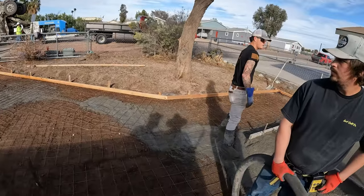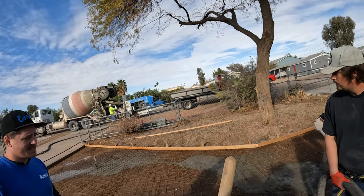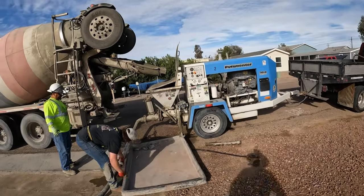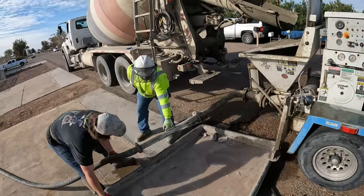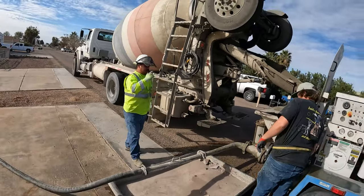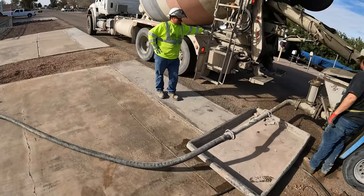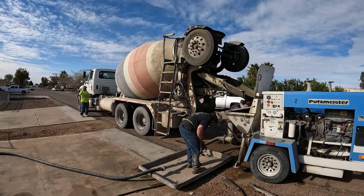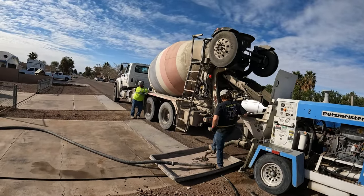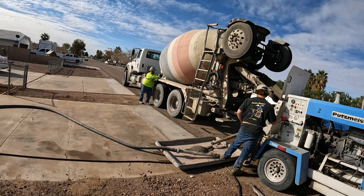It's rare but it happens — close to Death Valley type weather — so I'm using wire mesh rather than big steel because of the heat. Right here we clogged up. That's why the pump stopped. He looked over towards the truck because he could hear the difference in the motor sound of the pump. So he shut it down. He's going to release the pressure from the hose — CO2 or air pressure — so the concrete doesn't explode when he opens it. First thing he's checking is the manifold for a clog, so he busts that reducer off and runs the pump. The manifold is good — that's good.